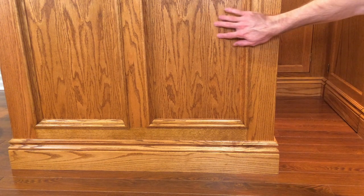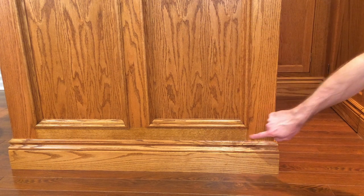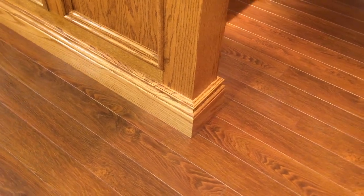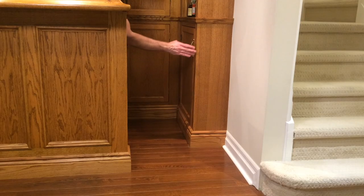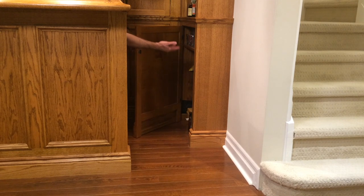I'll now go through the bar tour, and we'll start at the bottom and work our way up. The foundation of the bar is three-quarter inch plywood — it forms the L shape and it's been screwed together to provide structure. On top of that, I've added three-quarter inch plywood, and solid wood on the corners where it's going to take some abuse. I've got some oak trim here, and this is called panel mold — it works perfectly with three-quarter inch material. Because the bar backs onto the stairs, this is crawl space, so this is storage.